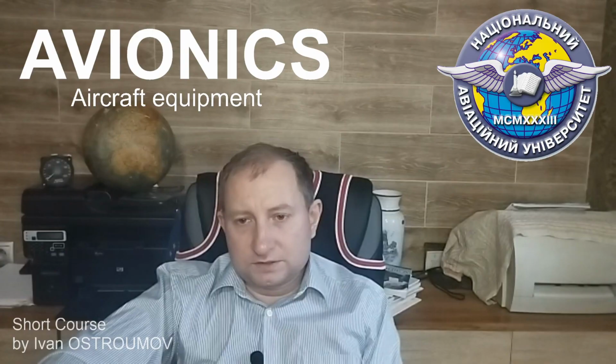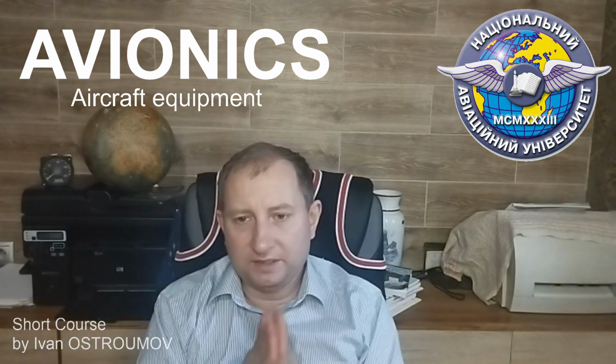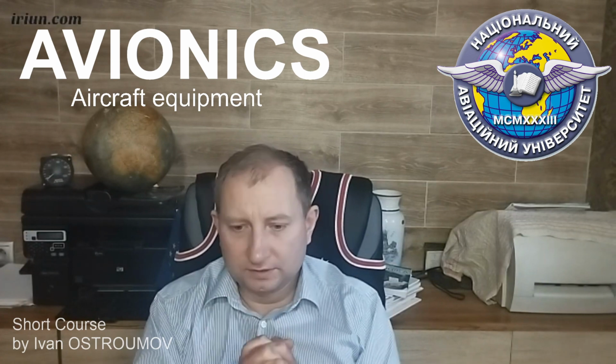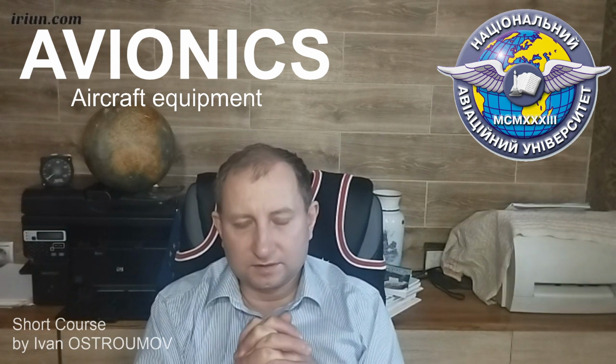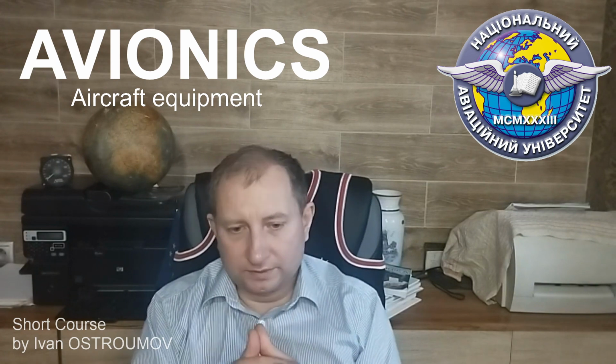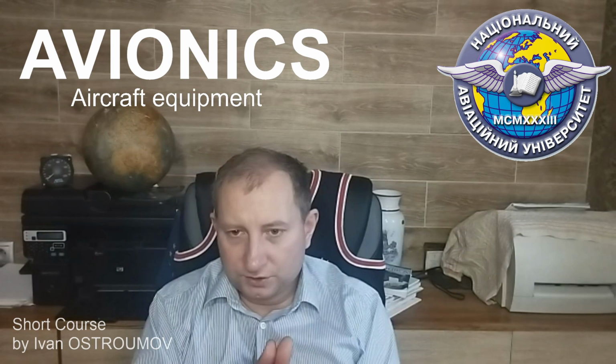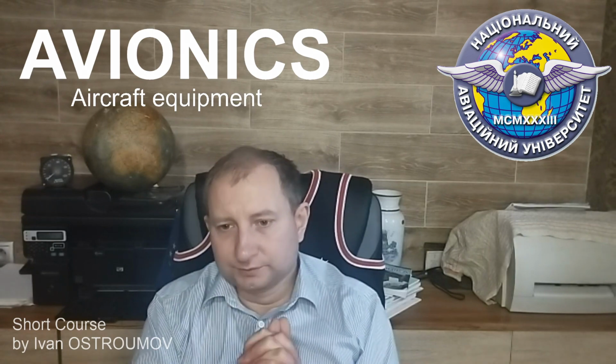That's all for today. Please try to remember that the LRU plays an important role, because without a line replaceable unit we cannot maintain our avionics on board. That's why all system components have to be divided into LRUs. We have two basic standards for these LRUs, ATR and MCU. And the idea why we have two of these standards is because of changes in generation of electronics. This is important. That's why please try to remember it.